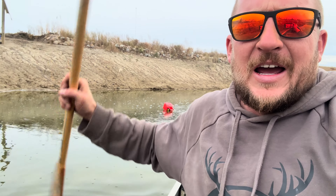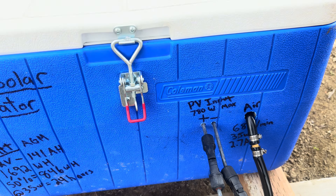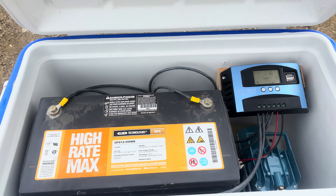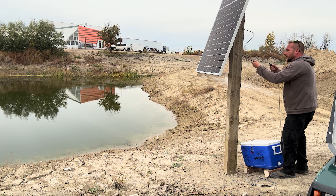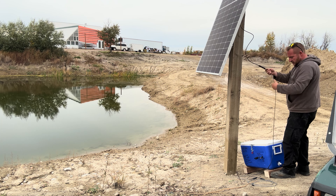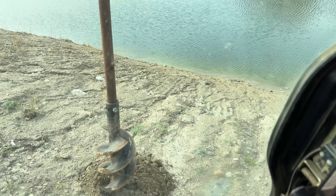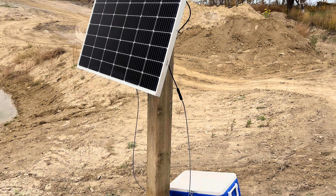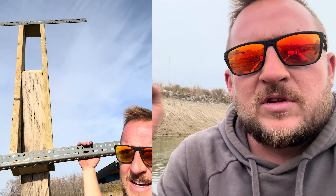To overwinter the fish properly with the amount I put in, I built myself a solar aerator. I used a 450-watt solar panel that I had stored and bought a few years ago. I put that on a single six-by-six post and made it adjustable — this is set to my winter angle so no snow will accumulate, and I can adjust it for the summer angle.